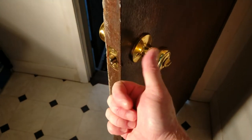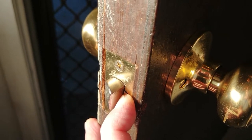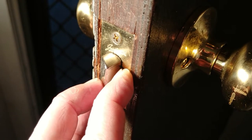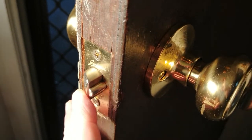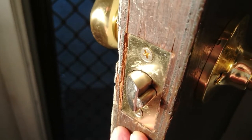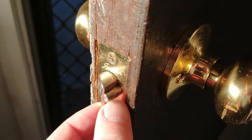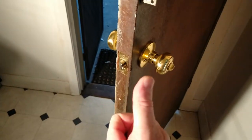G'day internet, CJ with you again. A couple of quick things before we start so I don't waste your time. It's a dead latch if it's got this little dead latch plunger on the back here. This is the state the lock should be in when the door is shut. If the dead latch plunger is not held in a retracted position by the strike plate when the door is closed, the latch is not dead and is free to be shimmed from the outside. If your dead latch is installed correctly, this trick won't work.